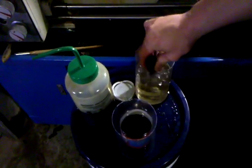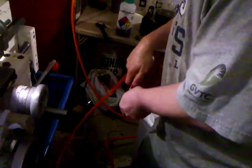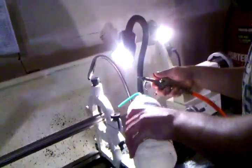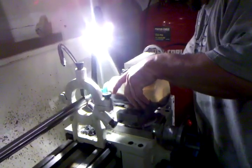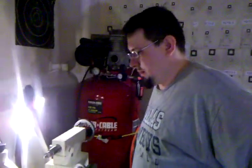Get most of the chips off and blow the remainder off with the hose. Put it back in my 520 cutting oil. Roll the chips down the barrel. Clean it out with a little bit of mineral spirits — get that through there, nice and clean. Add my 520 cutting oil and do it all over again, 50 more thousandths. That's my method.